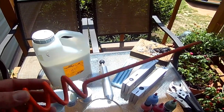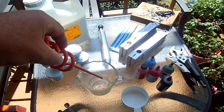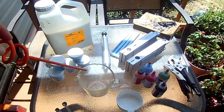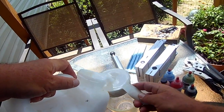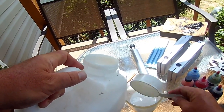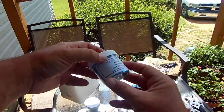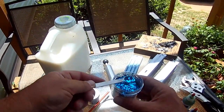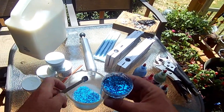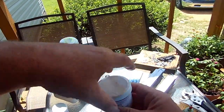Let's go ahead and get that going. I have this rod holder and I'm going to use the tip of it as my stirring tool. You don't want something flat because that will inject a lot of air into the mixture, and if you don't have a degassing chamber you're just going to have a whole bunch of bubbles — so you want something round. We're going to add one full cup of the liquid plastisol. We're going to be making a purplish color today — I have blue glitter and I'm going to be taking one 'tad' of that. A little dab will do you; you don't need to go crazy with the amount. And there's red, so we're going to put a little bit of red glitter in there too.